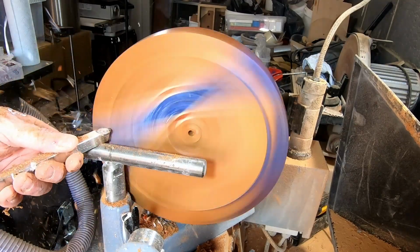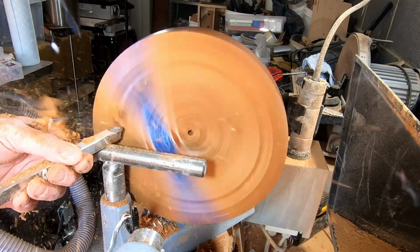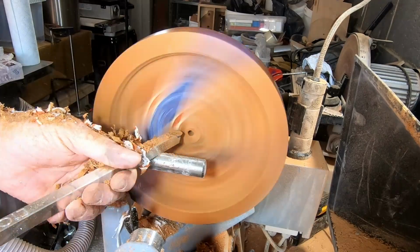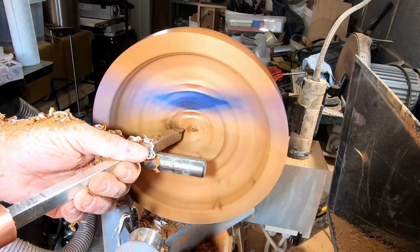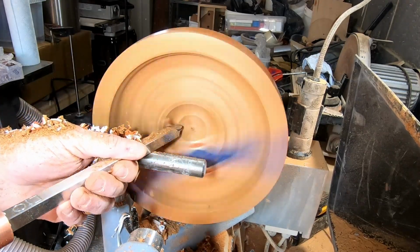The full-size finisher was great at removing material, but it was chipping the epoxy resin quite badly, though it could be improved. I had previously purchased a negative rake cutter for it, so I swapped that for the standard cutter, and what a difference that made. What tear out there was disappeared, and there were no more chips in the resin.